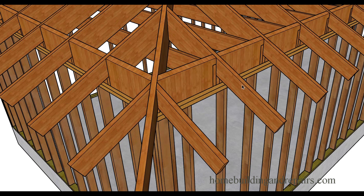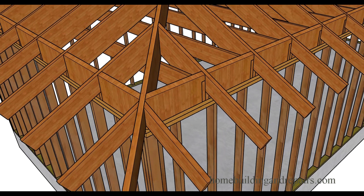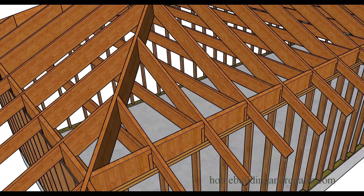You can see right here where the rafter tail is about 6 inches, and it comes up and is actually shaped — cut in here — so that you can put a smaller fascia board. If you had a 2x10 rafter and you didn't cut it, you would end up needing a 2x10 fascia board, which might not look good.